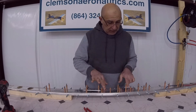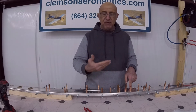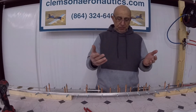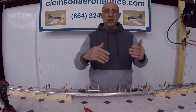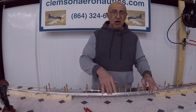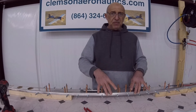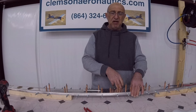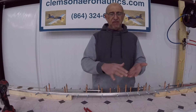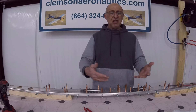The doubler needs to be marked so you know which side is facing forward, because you can flip it and have everything backward. But if you countersink it, you can't miss it — you know it's forward. As for the caps, you need to mark where those go. But none of them need to be assembled to do the countersinking. The countersinking of the top nine holes and the bottom nine holes in the center of the front spar doesn't require the caps to be there. So I'm going to disassemble it and do the countersinking by itself.